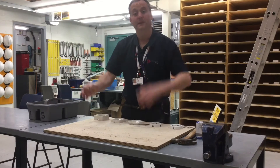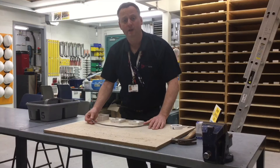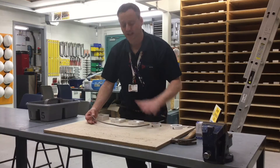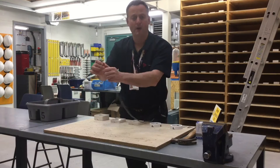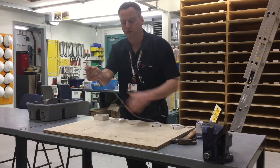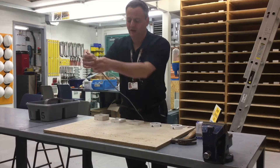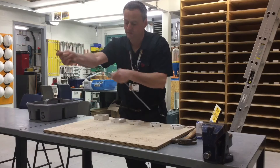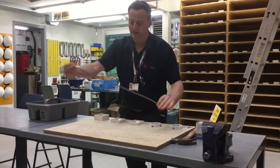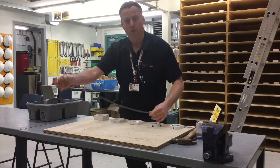Before we start, we've got the cable, and it could have been that it's come through a ceiling void or been placed through a floor with kinks and bumps in it, no different to our cable which is second hand. So before I do anything with it, I need to run my hands through the cable in order to remove as many of the bumps as I can before starting the dressing process — two or three times through with my hands to get it a little bit smoother.